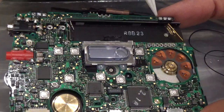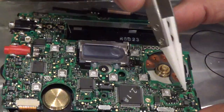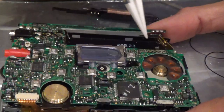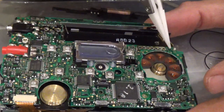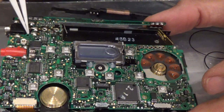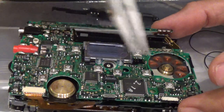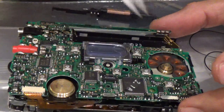These three need to come off on this particular Walkman, and these come off as well - that would just loosen the PCB. Also there'll be screws: one here, one here, one here, and one here. Pretty much, any screws you see on a PCB, open them all up.